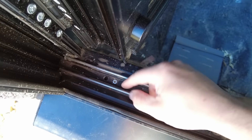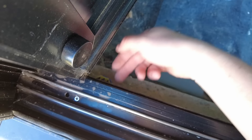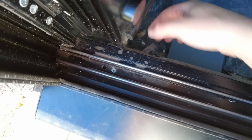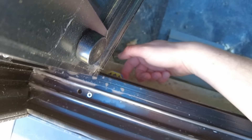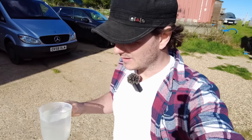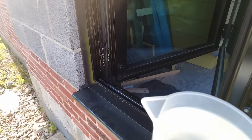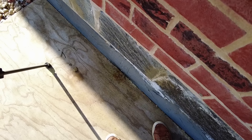This screw here fixes the frame to the seal. I might not have sealed underneath there, so it might be draining all the way through, or it's the concrete screw that fixes the seal down to the threshold. I'm going to pour some water down just to check exactly where it's coming through — I might have to drill this out to get the concrete screw out and then reseal it. I've seen on Facebook in the self-build groups quite a few posts of people saying their doors or windows are leaking — if you fitted them yourself you'd have half a chance of fixing it.